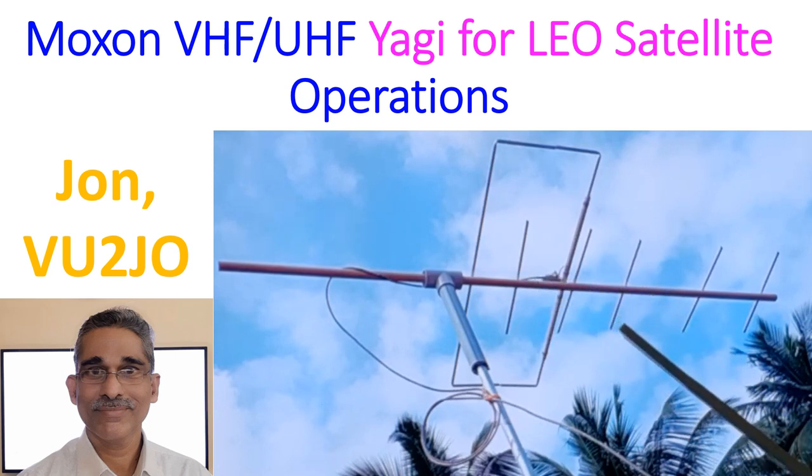Rotation in the axis is meant for adjusting polarization. We know that a satellite in orbit is not just moving around — it tumbles, and there are continuous changes in the direction of the satellite antenna. This is a linear polarized antenna, and when the satellite antenna is changing direction, they will not match fully well. That is why advanced operators use a cross Yagi with two elements in a cross, producing circular polarization. But this setup produces only linear polarization.